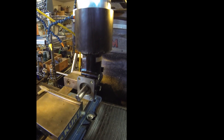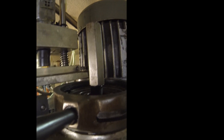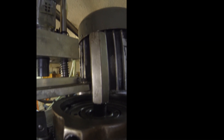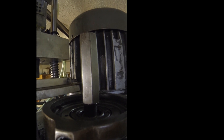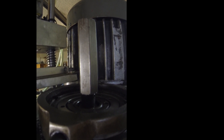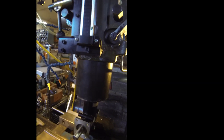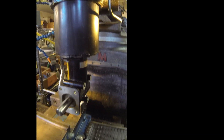The thing I had to do to finish this up is extend the draw bar. I took an old draw bar and screwed a piece of 3/4-inch hex stock into the end of it, adding about three inches. That gives me plenty of room to adjust it — didn't need to be quite that long, but that's the way it worked out. I'm very pleased with the project.